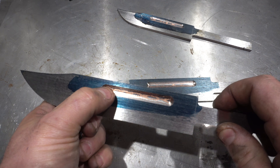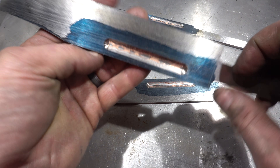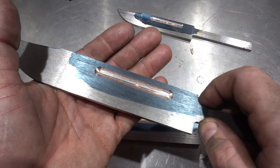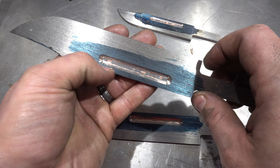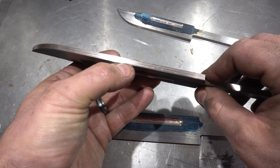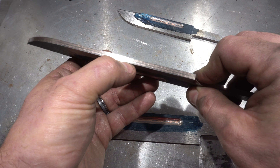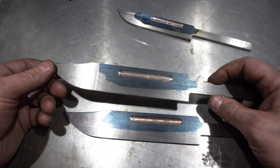You can see just about the same amount of copper on each side. This one you can tell is a wee bit off-center at the top — there's a double layer of copper here but not much of the second layer peering through. But looking at the edge it looks really close, maybe just 0.001 or 0.002 extra on this side, so that won't be noticeable once we grind the bevels.